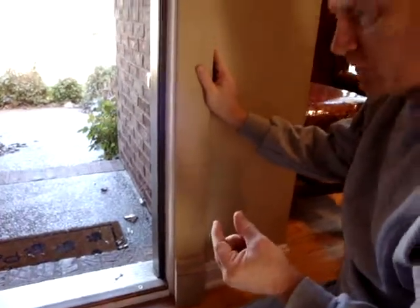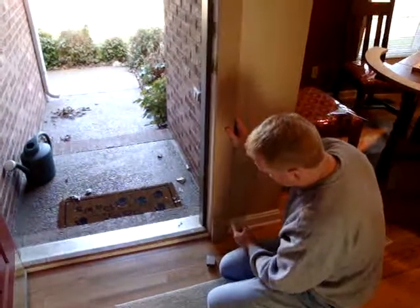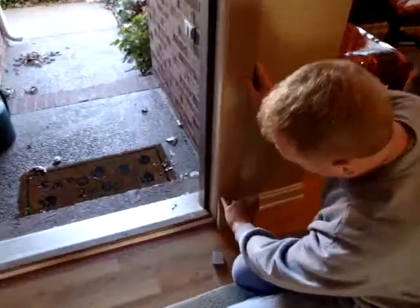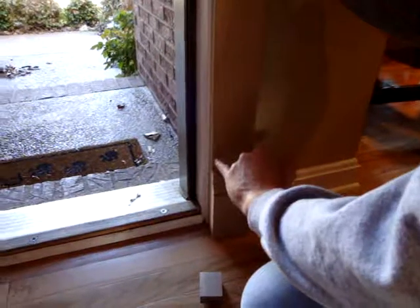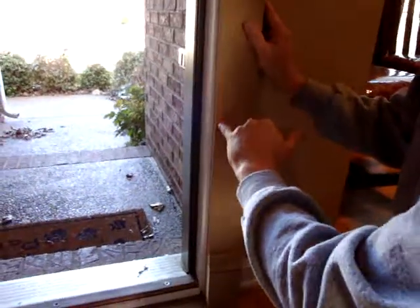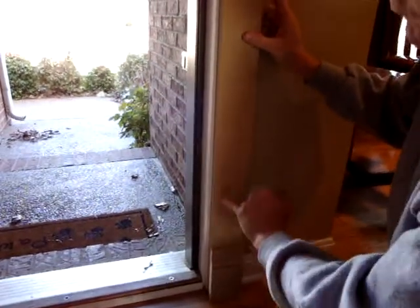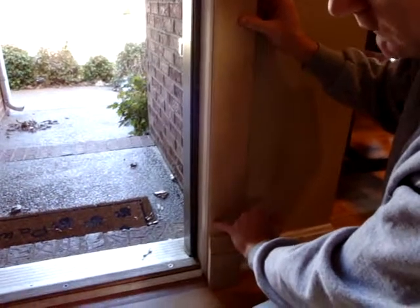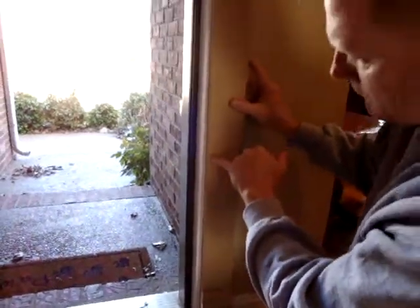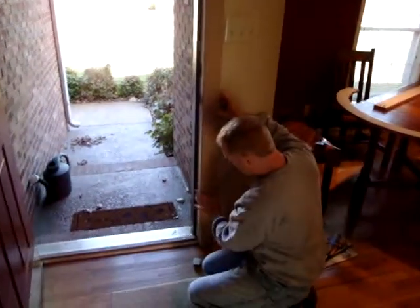You're going to attach it with some really small finish nails, small diameter, and you'll take a drill bit and pre-drill into the door casing. Drill through the molding into the door casing. About 18 inches apart should be sufficient. So in this entire thing, you'll put one right here at the top of this molding, and then you probably will have maybe 6 on each one, and then I'm not sure how many around the top. But so you're going to do that on this side.